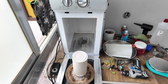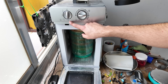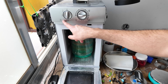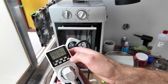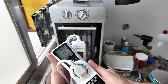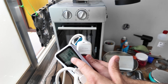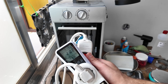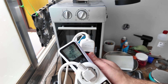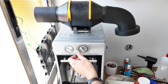I'm going to put it inside my microwave kiln and run the microwave on a low setting using a cycle timer. The microwave is set to 150 watts — the lowest setting, 1-4. The magnetron runs on full power for just a few seconds at a time, then drops to around 20 watts. After about half an hour I turned up the power to 300 watts, then 500, then maximum.